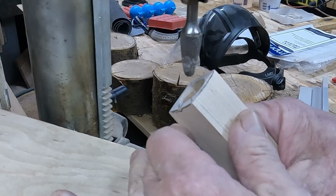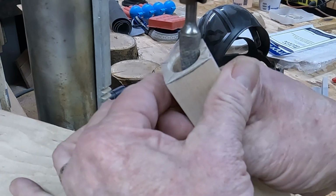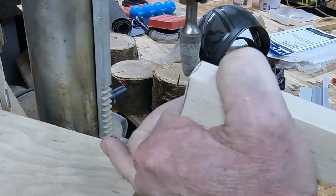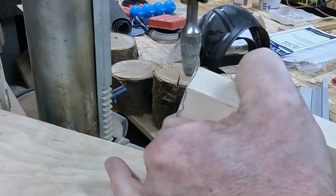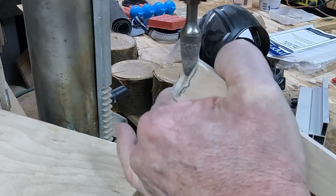No. The bottom of the crosses were flat and the tops of the bases were curved, so each one had to have material removed from the bottom. In order to achieve this, I put a conical bit in the drill press and pushed the pieces against the slow spinning bit until enough material was removed from each one. You should not repeat this activity if there are safer options available to you.